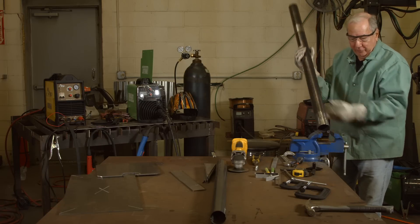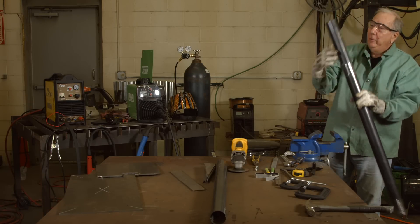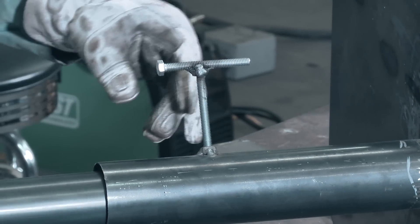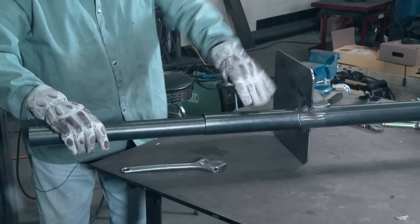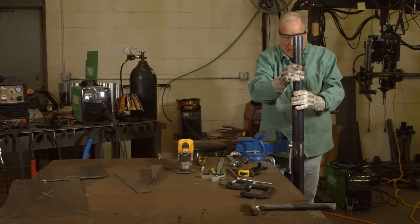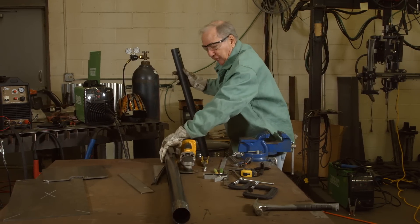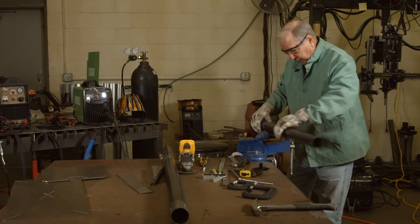In this particular pipe, this is going to be welded to the base. The table is going to be welded here, and up here I'm going to have a screw that's going to be able to tighten to hold the interior pipe in whatever position you choose to have it. And of course we're going to have an arm coming out here if you need to do overhead work — you can raise that up to whatever level you need to. The last bit of grinding I have to do is right here where I'm going to weld the arm in place eventually.